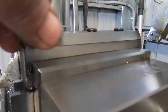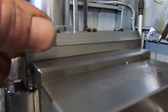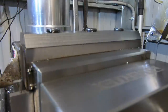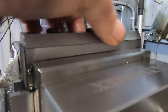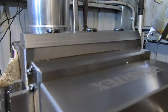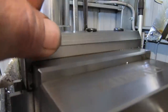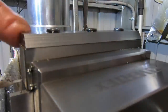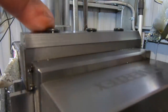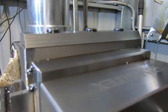Look, honestly, I am a little bit disappointed in that finish. I'm wishing I had spent the time and built another fixture so this was actually flat and I could have used a shear tool, but I think I can save it with a bit of files and emery and clean it up. But it is what it is. So I'm going to take this one out and put the short one in and do the 60 degrees on them ones.